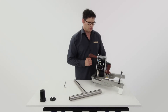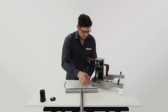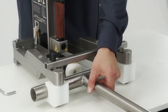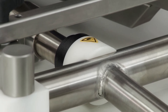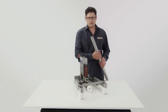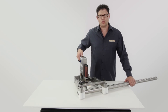To align our top bar, we would work on the building site like this. So that we can better present it now, we'll work with the piece lying down. We put the pipe into our tube bending and straightening device, start our bender. Didn't I say straightener and bender? Then let's bend something. Let's imagine I'm at the building site, and the pipe which I previously bent in the workshop doesn't fit. Now I use the CBS to adapt the pipe to its surroundings.